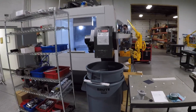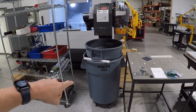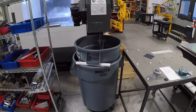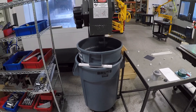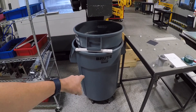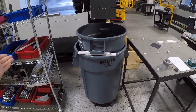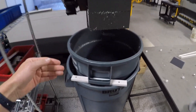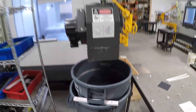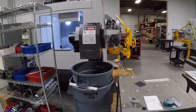First thing, we figured out a pretty easy hack to improve the way our chips are collected. We stack these bins and we've drilled holes in the top bins that function as drain holes. So a decent portion of the coolant that ends up clinging to your chips does drain into that bottom bucket. You can choose then whether you want to clean that, pour it straight back into your tank, or recycle it. But what we wanted to do was try to get chips that stay a bit drier, so that when we move them into our Gaylord bins for recycling, they're not filled with a bunch of liquid.